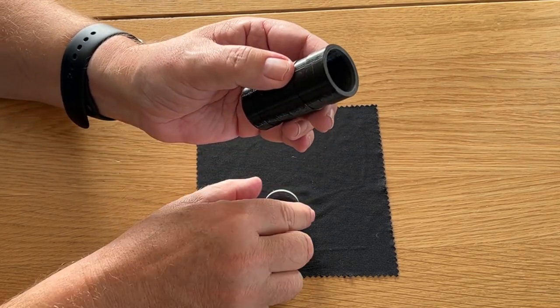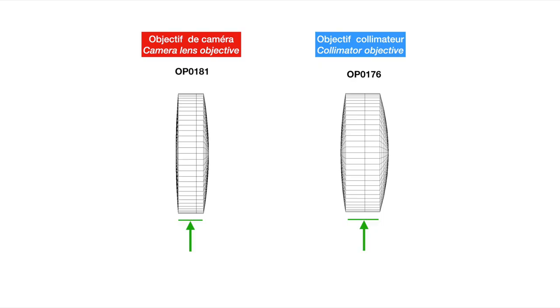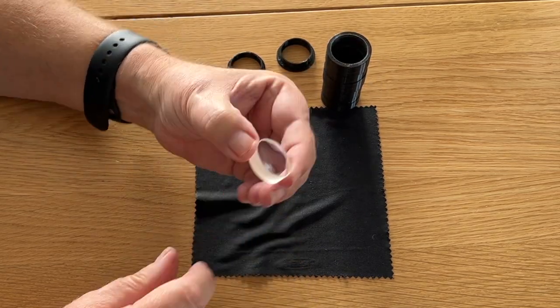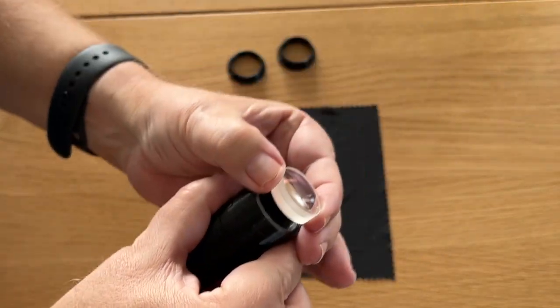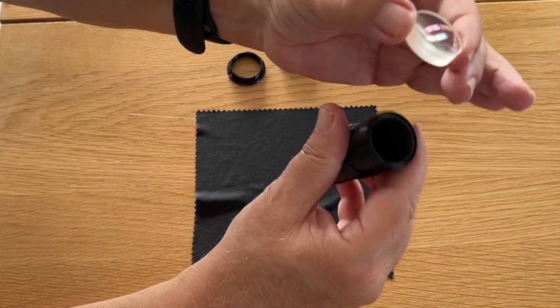We will now place the collimator lens in the collimator tube. Do not confuse — there are two objective lenses in the Solex optical kit: the collimator lens and the camera lens. The collimator lens is referenced in its bag as OP 0176. It is easy to recognize because it is the thicker of the two — you mount the thicker one in the collimator tube. Pay attention to the mounting direction: it is not indifferent. The side that will be outside is the more curved of the two. The lens is an achromatic doublet, and the thinner element must also be towards the outside of the tube. You must not make a mistake, otherwise you will get very degraded images.